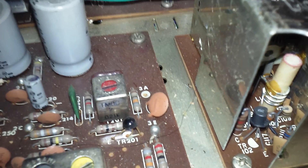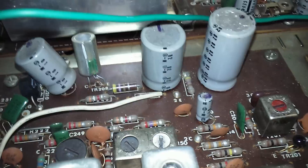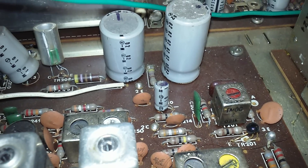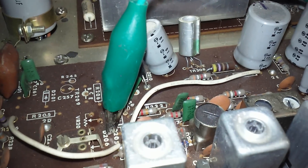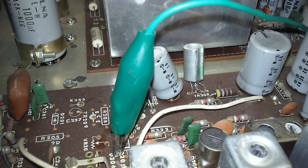The main thing here is I'm literally clipped onto the back side of a diode. This is the detector diode, or just one of the detector diodes, because essentially what this radio does is it mixes the local oscillator — that transistor and that can, as well as one section of the gang tuning cap — which forms an LC network making a local oscillator. It's run through the IF cans, the signals are mixed, and then basically you get at 455 kilohertz your AM signal, which is fed directly into a detector. So I've pulled from the input side of the detector diode — I've pulled the IF signal.